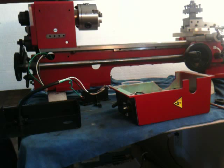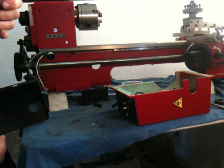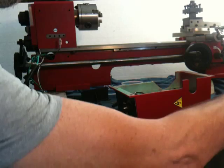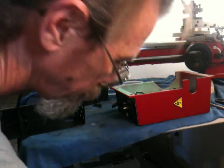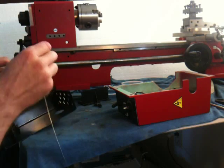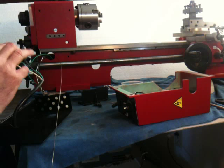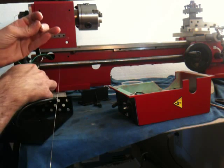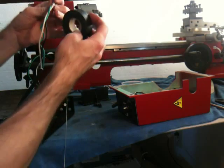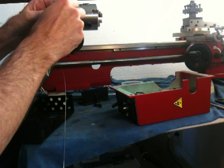We're ready to put the electrical on. This mounts on the back, covers the motor, and these leads have to come through here — it's sort of tight. So I got a little piece of MIG wire to use as a fish tape. I'm going to shove that on through. I already made a little hook on the end so I'll hook that there, and take my electrical tape to tape the ends together so nothing jumps off the wire.